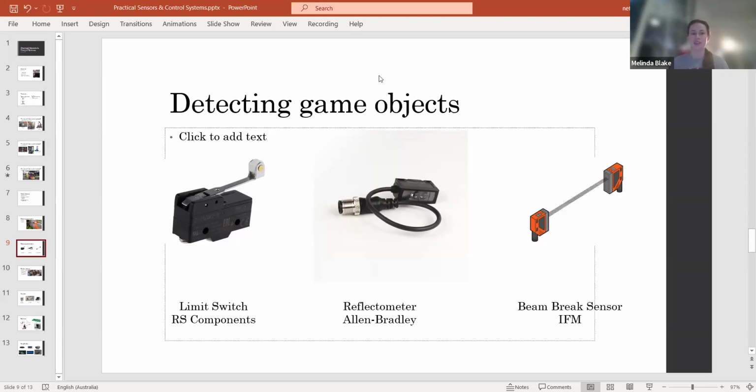Do you think those risks are sort of high enough that you're better off to avoid using them? Yeah. So I probably should have included the Hall effect sensor, because Hall effect sensors are literally $5 and they do the same thing that a limit switch does. The only thing that people come across is that the switch point is not entirely defined. So that's probably the only advantage with a limit switch, if you really need a lot of precision to your location. Generally, you don't need that much. Generally, a Hall effect sensor is perfectly fine and literally $5. I can't see any reason to use a limit switch.